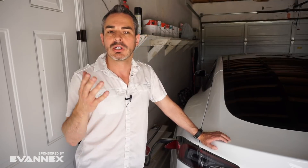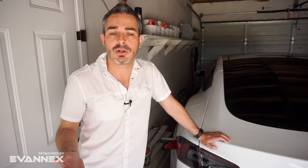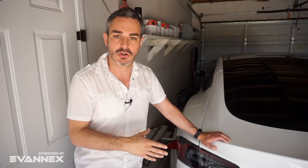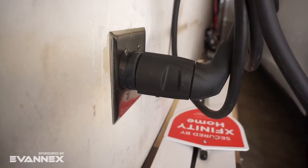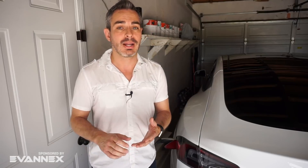Now let's talk about charging at home. If you own your home, it's much easier — you can modify your electrical panel and install charging stations as you wish. I strongly recommend hiring a licensed electrician. You need a dedicated breaker running to your charging station or outlet, and you need to make sure the amperage is correct. I'm not even using a Tesla charging station — I'm using the cable that comes with the car, which plugs into a 240-volt outlet. In the US, that's not a standard outlet you'd normally have at home; the only one you might have is for your dryer.